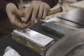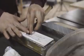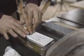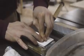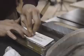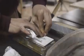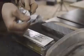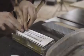So here I'm showing you exactly how I'm holding the chisel. I got my pinky and ring finger wrapped around the back for support, and the rest of them are pretty much holding it in place to make sure I'm not rocking the bevel and making sure I'm staying dead flat. My right hand is pretty much doing most of the work. My left hand is really just balance. I'm showing you the 2-finger technique here, but I end up using just 1 finger later on.